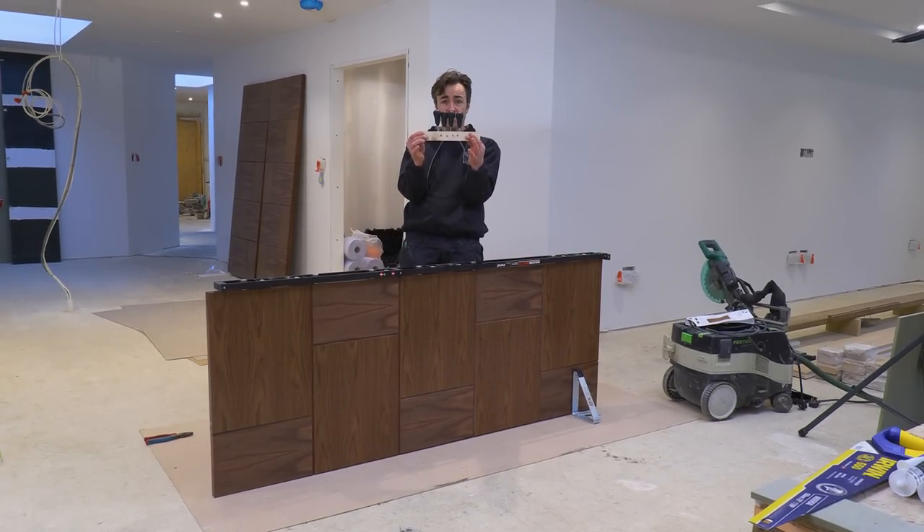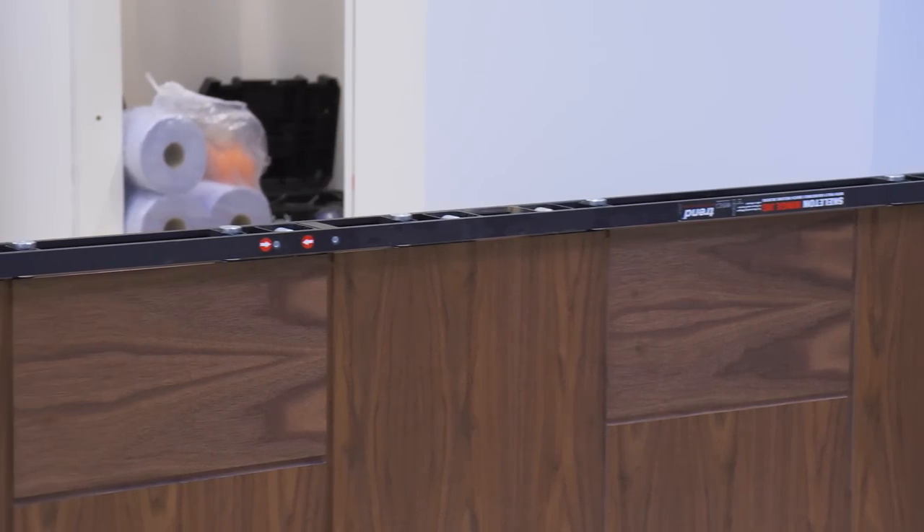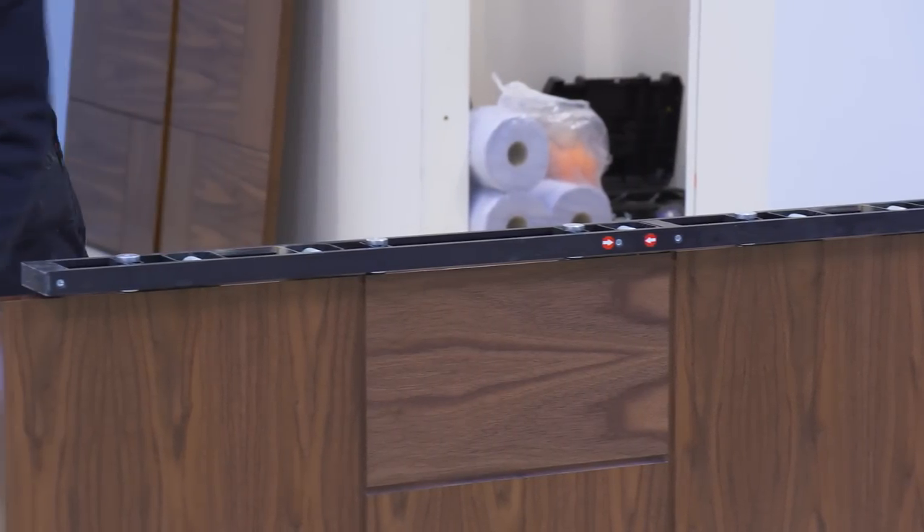With the skeleton hinge jig you get braddles. My first little tip: when you've got them they've all got little black plastic ends — keep those sharp. Take them out and put them into a scrap of timber so they're not getting lost or kicked around. I'm not going to be using these on this door because I don't want to be banging them through this walnut — potentially splitting it, potentially making another hole to make good. I don't mind using them on the lining because they're going to be fully decorated.